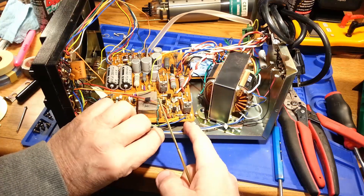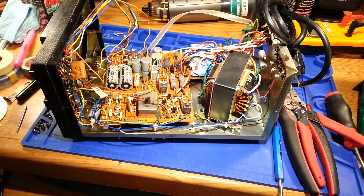And if you can handle these connections in a way where they are not loosened up too much, you can pretty well just slide them back onto a pin. If you desire, you can put a small tack of solder on and that will be an adequate connection going forward to get the equipment back into service properly.